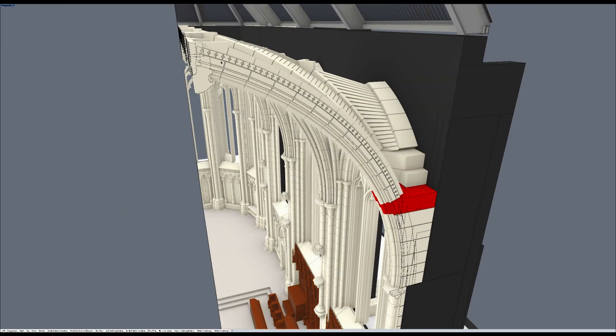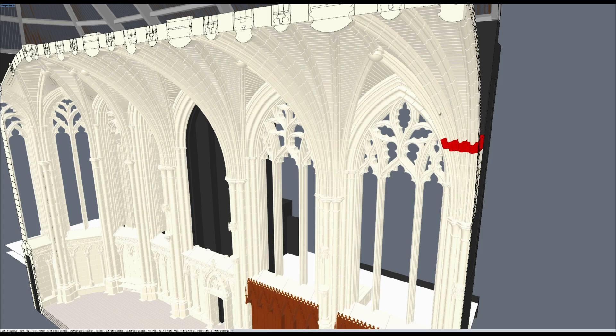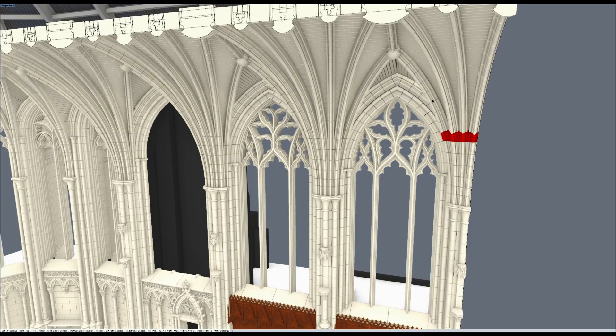What we have here is this is the main rib of the vault. The thrust — the weight of the vault — is coming down, traveling down this rib. It's running pretty much perpendicular to the joints, so it's cutting straight across; each rock is just pushing on the rock below it. Gravity is what actually holds the vault in place. You might think the vault would collapse — shouldn't gravity cause those stones to come plummeting down? But actually, if it wasn't for gravity, the vault would collapse, because gravity is what keeps them locked together. That gravity is pushing from stone to stone all the way through these joints, and all that weight — which is increasing — is coming down. Because the vaults are fan-shaped, all the weight from all these ribs is coming down and focusing on this point between the windows. That's how Gothic can have such large windows, such walls of glass — they channel all that weight to this one very critical spot between the windows.